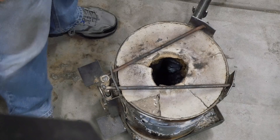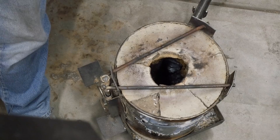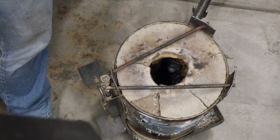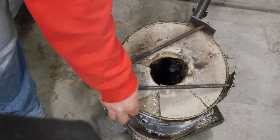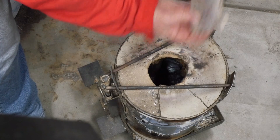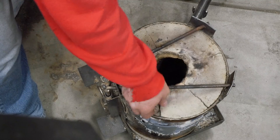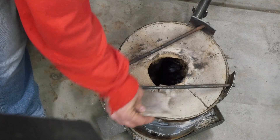Here is my furnace — my poor furnace — after a lot of heats. I've probably melted 20 to 30 times in this furnace and it's held up pretty darn well considering. The lid is actually two layers: the refractory mortar on the bottom, and the refractory castable fire brick on the top. I didn't have a lot of material, and you can see when I poured it, it was really pretty thin — only maybe three-eighths of an inch or so.